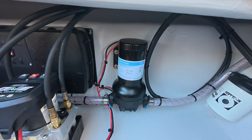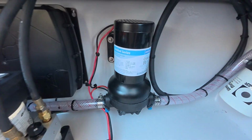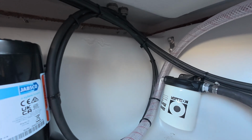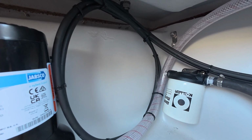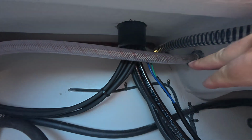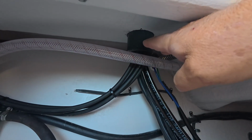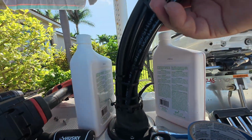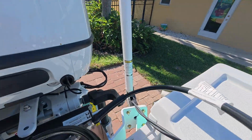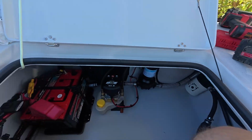And then the water pump, and I used the water pump hoses to kind of support some wires. I made a great big loop. Probably could have gone tighter, but didn't need to. That's the PowerPole hoses. There's 4 of them. They loop right around here, and this is the outlet for the saltwater washdown. And then everything goes up through the deck, right through here. And we've got 1 set of hoses and 2 right here, 2 sets of hoses. So this compartment is done.